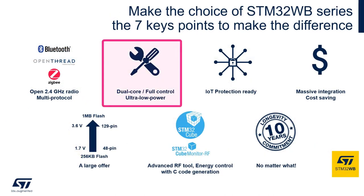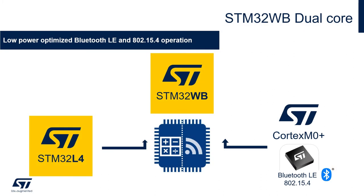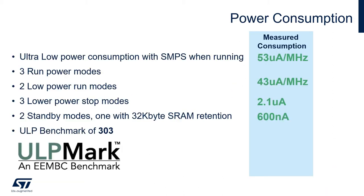Dual core and full power. Inside the STM32WB we have integrated an STM32L4 core with a Cortex-M0 core and our own Bluetooth LE radio. All STM32WB devices have dual core capability which allows very low current consumption. We also have multiple low power run and sleep modes, and even a low power mode where we save Bluetooth context consuming 600 nA.